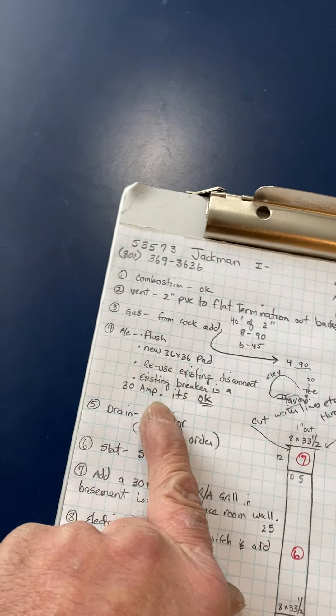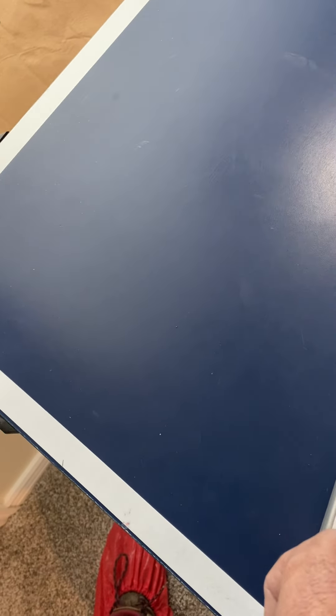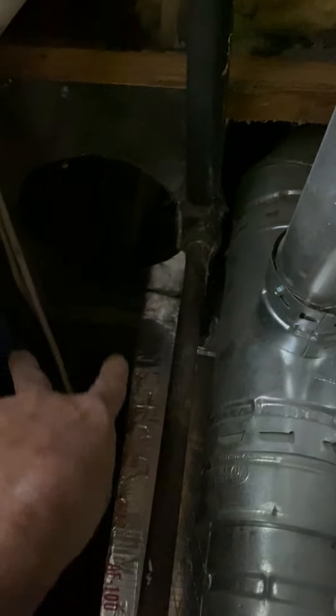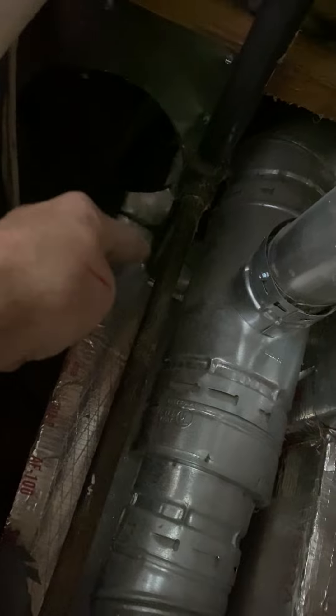Okay, AC — I'll go over that in a minute. The drain, just to the floor drain. On your return, the cut line is obviously at the joists, so you're going to remove all that duct board there. I'll give you a header to re-header what you need — I see it's all open on this side, so just re-header what you need and do whatever you can there.